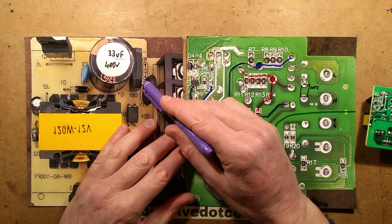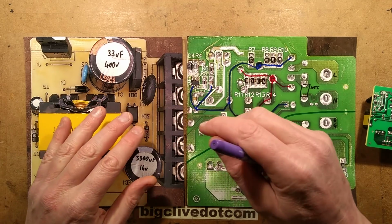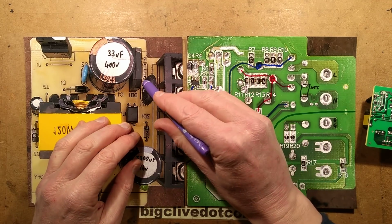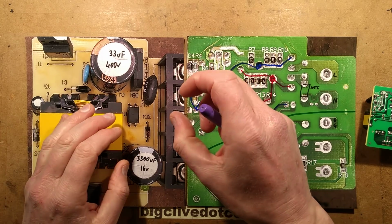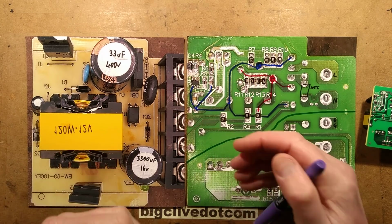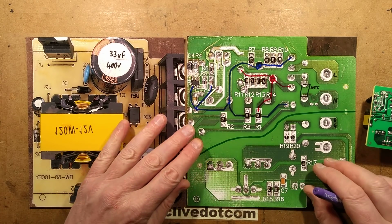So this starts off with a slightly higher resistance, about 5 ohms, as I say, not much, but then as this warms up, because it will dissipate a bit of heat across it because of its resistance, it then goes down in resistance, and it just wavers up and down. It will stay warm in operation. It's just how they work.